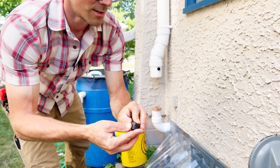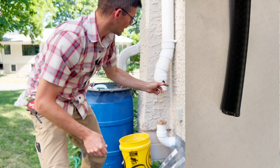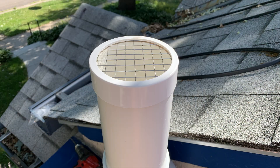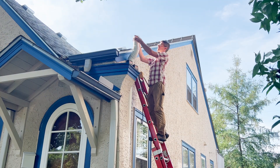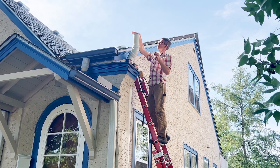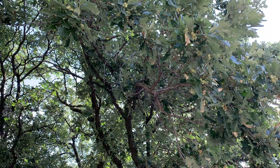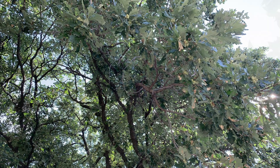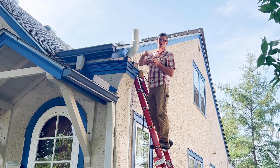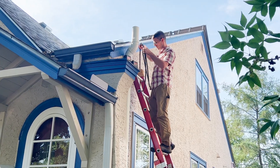We'll set that grommet assembly aside for now, as it's easier to get our cable from the top and then down and through, and then we can add that stuff at the end. Now at the top of the pipe, you may or may not have a critter guard cap. That critter guard is just a half inch screen mesh that goes over the top. In this case, we installed it because we have an oak tree right above us, so we don't get acorns and leaves falling down there. We're going to have to cut a little bit out to allow for the heat cable to go down, but first let's get the heat cable down the pipe.